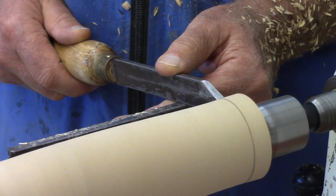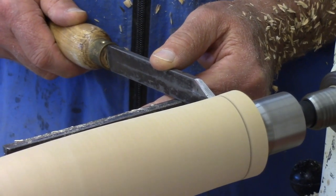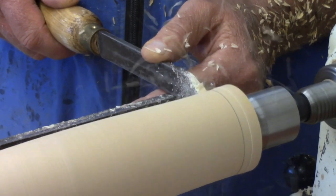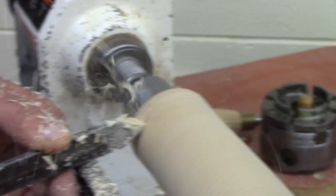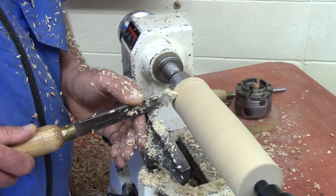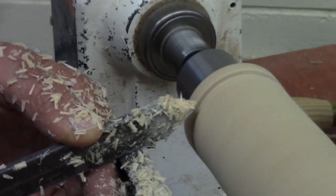Now I'm taking my bevel, I'm resting it on top of the part, I'm bringing it back until the edge is engaged with material. It's all about sound. Listen. There it is. There's the chip. Now I'm pressing lightly in short segments, so we don't want the tip to overheat. So I've done about 4 or 5, maybe 6, 7 segments.